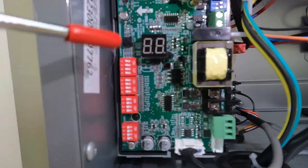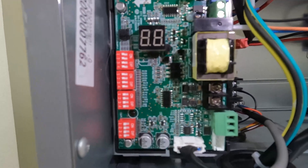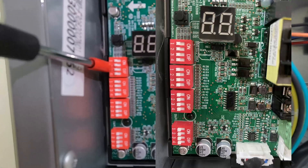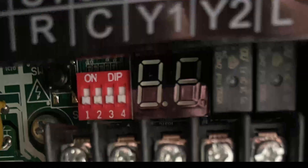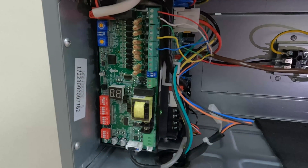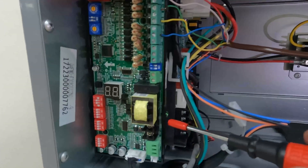No other wires should go into S1 or S2 — this may fry your board. For this wiring, you'll see SW1, SW2, and SW3 for your dip switches. They should all be set to OFF. And for this installation at the CPR, those dip switches should all be OFF as well.